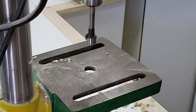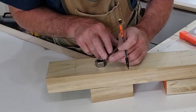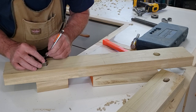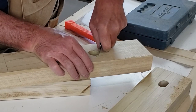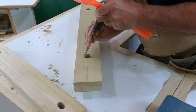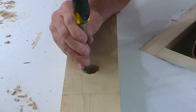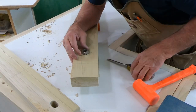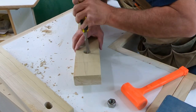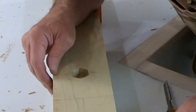The next step in the process is to do some chisel work. Since two nuts are recessed into the one-inch holes we just drilled, I marked the outline of the nut centered over the hole and used a utility knife blade to mark my lines and give me an edge to work against with the chisel. Using chisels for detail work is something I don't do that often and as a result, I don't sharpen my chisels that often either. I'm amazed at how sharp some of the woodworkers I see can get their chisels and the ease with which they trim up detail work like this. It's something that takes some practice and effort, and I'm always impressed when I watch those kinds of skilled people do that kind of work so well. I'm thinking that once I get accustomed to using the Moxon vise and commit more time to my finer cabinetry interests, maybe I'll gain some proficiency to do detail stuff like this much more effectively than I do currently.